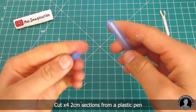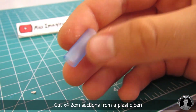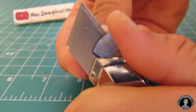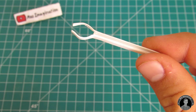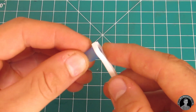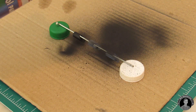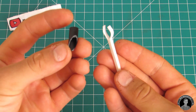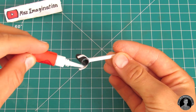From an old pen, cut two centimeter short sections of pipe. Slice the end of this pipe diagonally, sort of creating a foot for your drone. The arm wraps around it like so. Make three more of these and if you want, you can also spray paint them any color you'd like. With the arm wrapping around the pipe, superglue the two together.